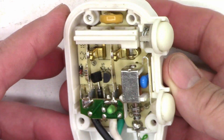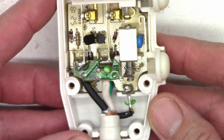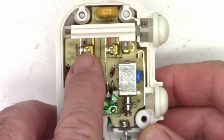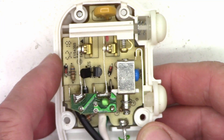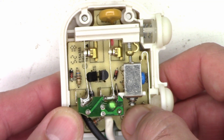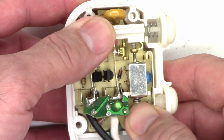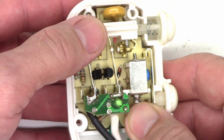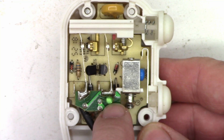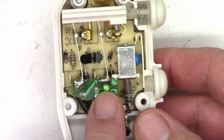If I go ahead and open it up, let's take a look at what's inside. Now this is not to be confused with a GFCI — Ground Fault Circuit Interruption. This device does not do any GFI or GFCI protection. So before I even plug this in, let's show you how this thing works. This would be the live side right here, and this would be the neutral side. There's a small solenoid plunger right here, and its intention is to press this little plunger, which releases a catch in this sliding assembly. The live and the neutral are now open — no power is going to flow through this device. This right here is simply an LED indicator to let you know it's got power; it lights up to tell you that the contact is closed.